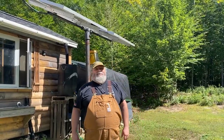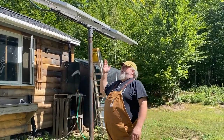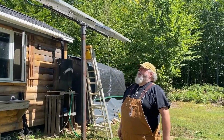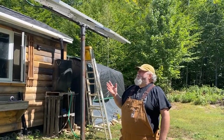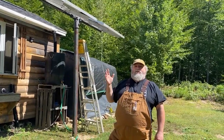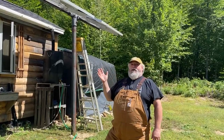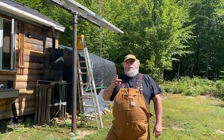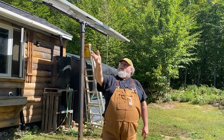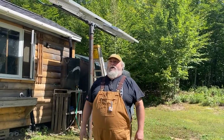Okay, so the place where the solar power actually starts, obviously, is here in the panels of the collectors. A lot of people don't realize this, but here in the northern hemisphere, the sun travels in the southern half of the sky. So you'll always have your panels, for the most part, facing due south, because the sun rises in the east, sets in the west. That keeps it as close as possible to square with the array. That's how you catch the most of your power.